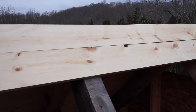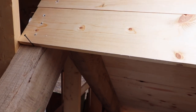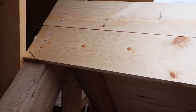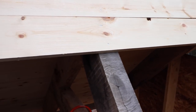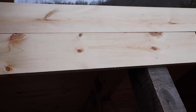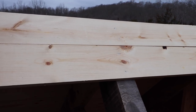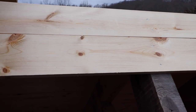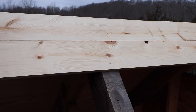I'm up on the roof putting these 1x8 pine boards on, and I'm spacing them with nails here because even though it's wet and raining, it's still pretty dry winter air, and come summer humidity these things are really going to swell. So they're getting about an eighth-inch gap to allow them to expand and contract. I'm not worried about air sealing because there's going to be five and a half inches of rigid XPS on here with the seams taped and caulked — that'll be my air resistive layer. Then it'll get 2x4s and another layer of sheathing, and then roofing on top. So it'll still be vented even though it's a cathedral ceiling.